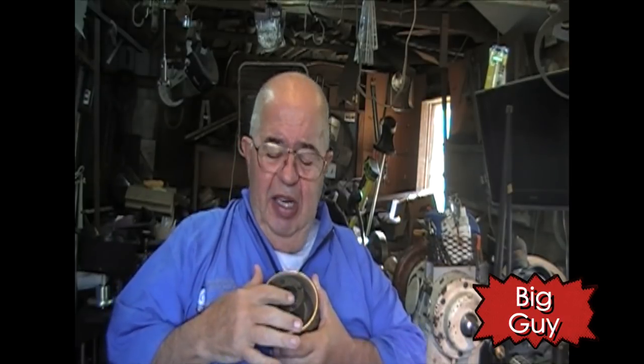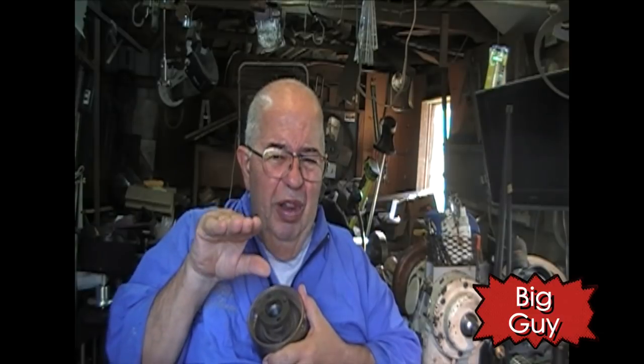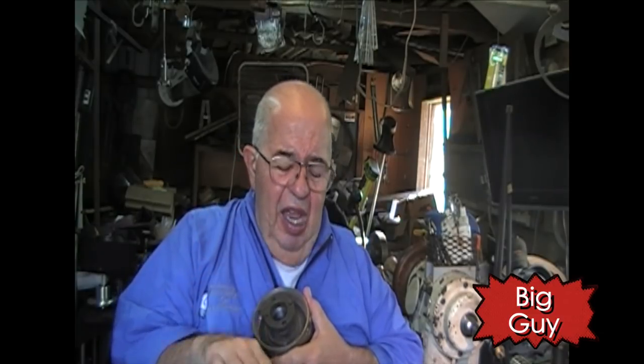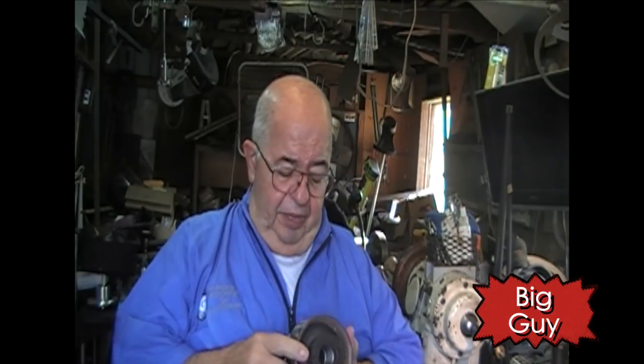That adapter in the back, that part back here, that's not the adapter. That's the ring as part of the chuck for putting it onto the piece. If you have to put a spacer on to get from the chuck out to a thread, you've added one more link in that chain and it could flex. Don't tell me all the science on it. I'm telling you, it flexes.